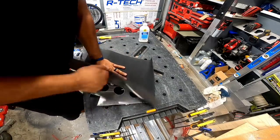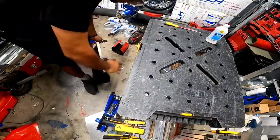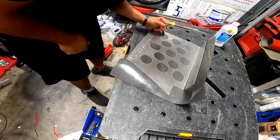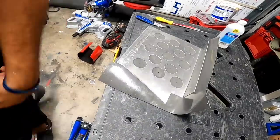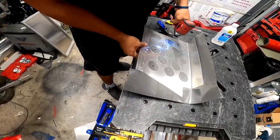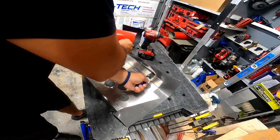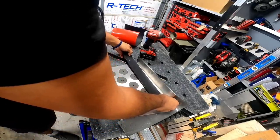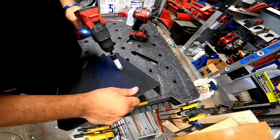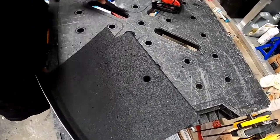We initially had nine holes and I made another four to give it different spacing and also possibly store extra rods, because you can store two rods to a tube if you do it tactfully. But those grommets we used in the other boats aren't really an option now with spacing that tight — I don't really like them anyway; the way you attach them is kind of crappy. So what we're going to do now is try this with gator skins non-skid. We'll do one side and then double back it, one on each side so the 3M tape is stuck to each other — that'll never come off. We marked it in the front so we can mark it in the back and drill completely through so it's perfectly centered on each hole.